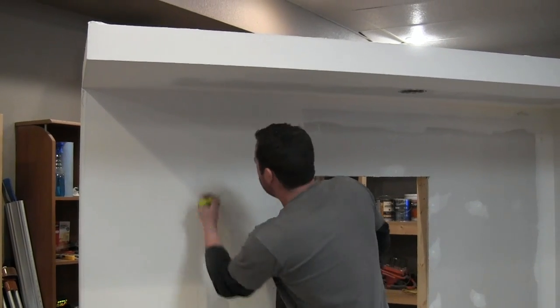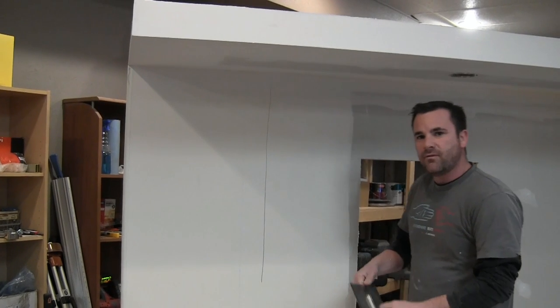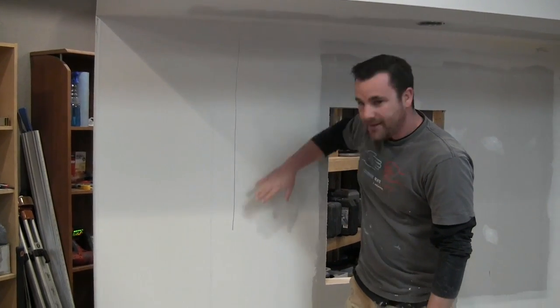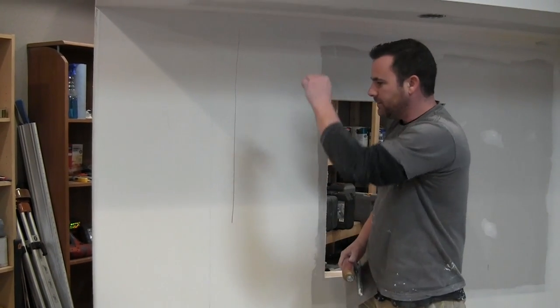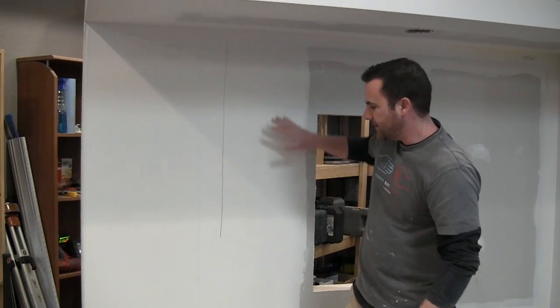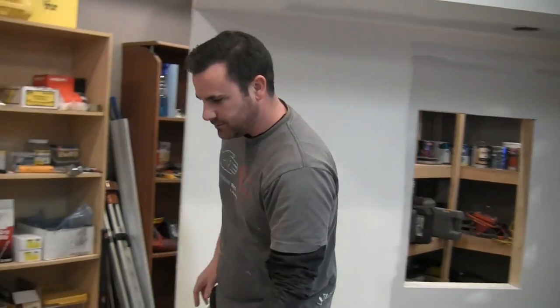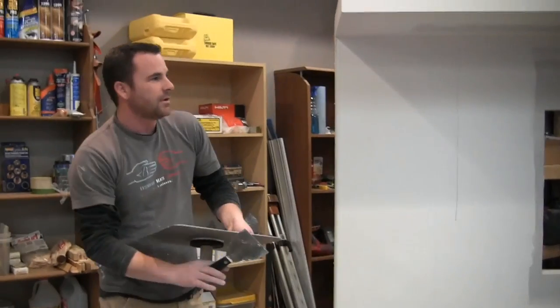What I'll do is mark this line here so I know to sand it out before I coat again. All I'm going to do is sand that to make it flatter, get rid of that hump, and then I'll probably do two more skim coats. That should finish this whole area and level it all out. But that's later — we'll just take care of these angles right now and catch those up to the rest of our job.